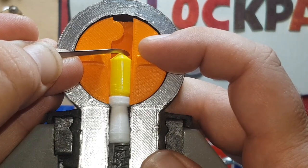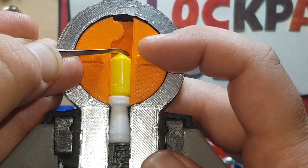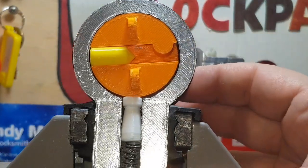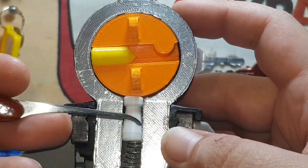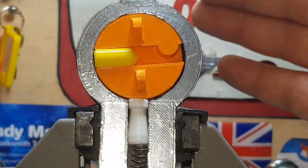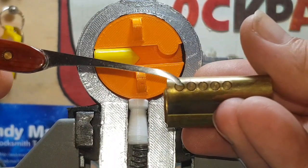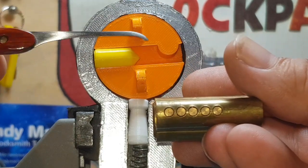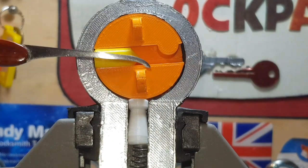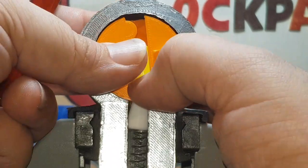Then what's going on — you're going to get that counter. This is the important part: when you get to that counter, keep that tension light but sturdy, because you don't want to go to the point where it flicks and all your pins drop. Then what you do as you get there — you slowly push on that key and pop — you're going to get your open. Now, even though this is a slice of a lock, you've got to visualize that this is like a five-pin standard euro. We have one, two, three, four, five pins — this lock would be the third section, so you've got a couple of pins ahead and probably one behind. That is how a mushroom pin works that way.